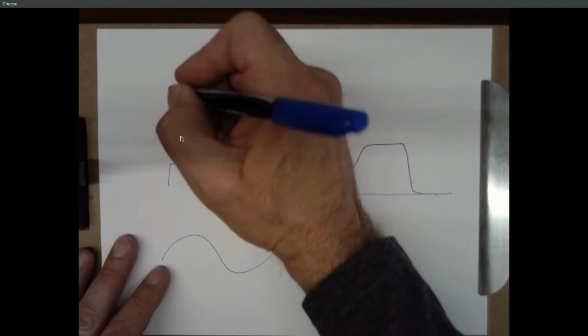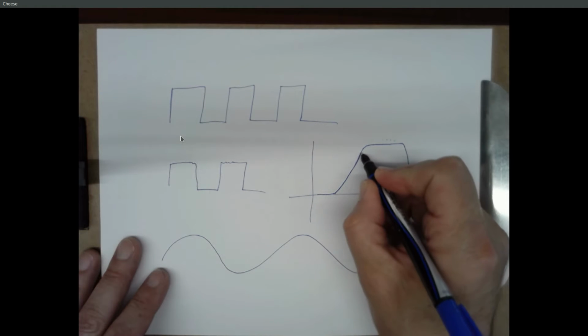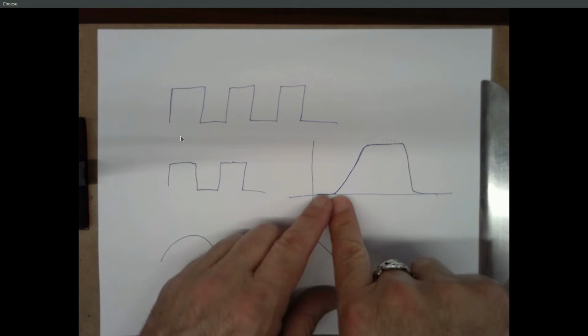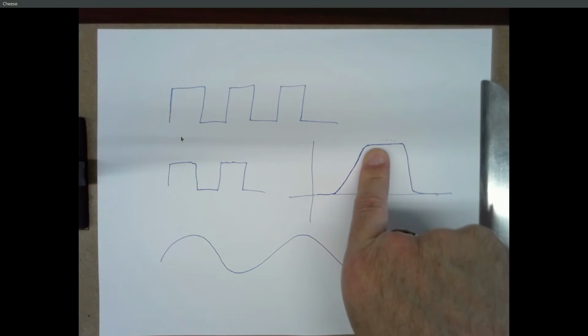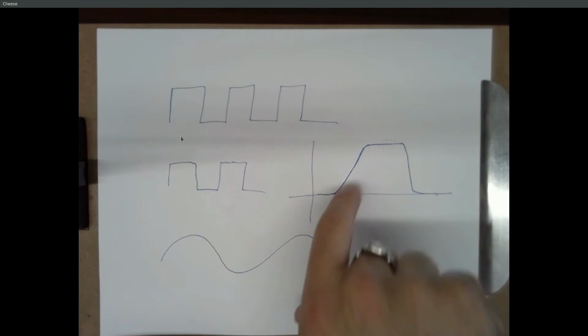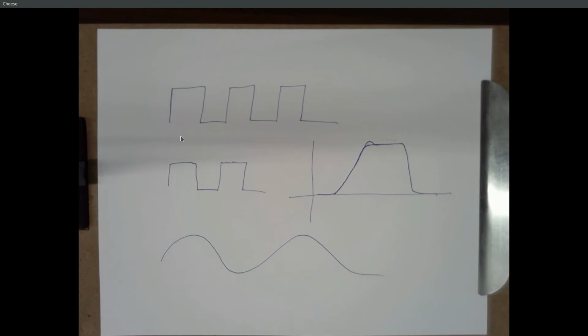But the way it's actually going up is not instantaneous, as you said, from 0 to 5 volts. It actually has to go up smoothly, because it's a real-world device, and most things don't change instantaneously in the universe. They move continuously, so the voltage actually goes from 0 to 0.1 to 0.2 to 2.5 to 3 to 4, up to 5 volts. And when it gets to 5, it doesn't just suddenly stop climbing, it's going to slow down, and so we get this little curve there, or maybe an overshoot, and then it comes down. Those are the non-ideal parts of physical generation. And then the high frequency one just looks all wrong because it's struggling to keep up.